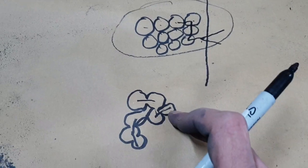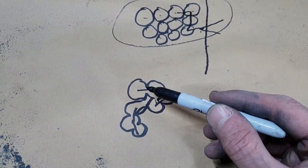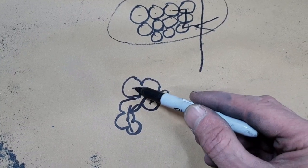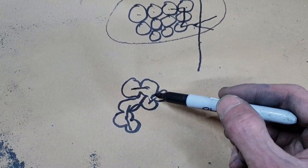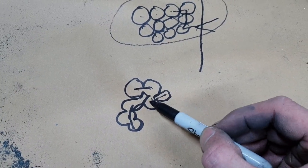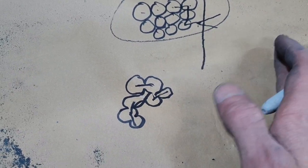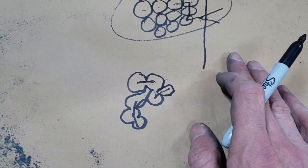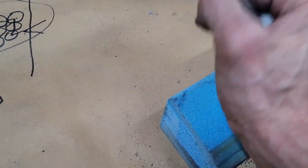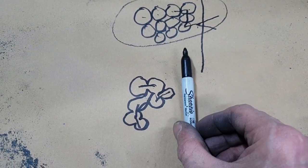Now, because this is controllable, in that you can control the cure rate. If these are slower to cure, they can provide voids between the cells. They don't skin over as soon, and you have a communal area between all the cells. This can be controlled in that the air can travel through it and provide, in this case of the cockpit surround, energy absorption.